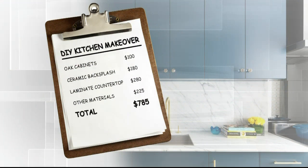You can tackle your cabinets with a full kit in a weekend — countertop, backsplash — and get it done really effectively and cost-effectively. So, the oak cabinets first: the Rust-Oleum kit for making over cabinets is $100. Everything in that kit includes a deglosser — which means no sanding. I did not sand those cabinets. It takes off the finish so you can just put on your primer coat and your top coat, all in the kit. That $100 did all those cabinets. Replacing them new, professionally installed, would have cost at a bare minimum $5,000. So we saved over $4,900 on the cabinets alone — that's maybe an entire family vacation for some people.